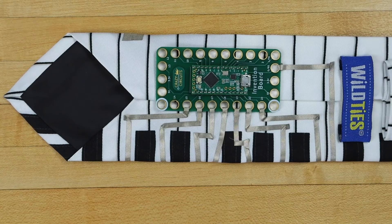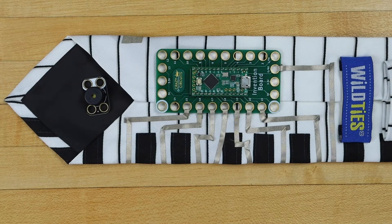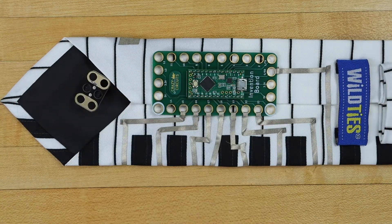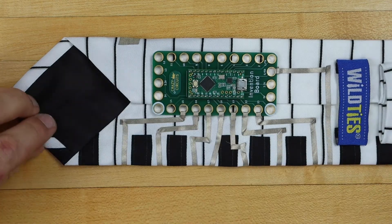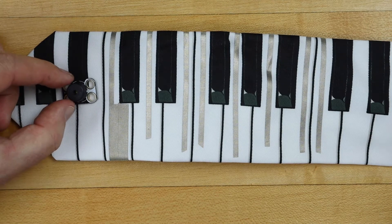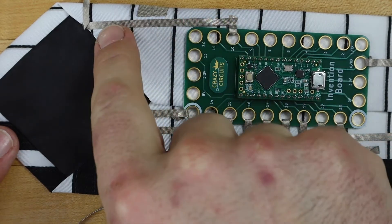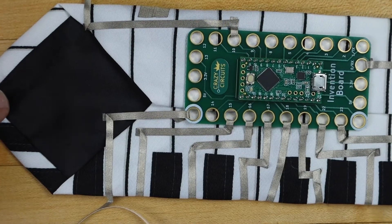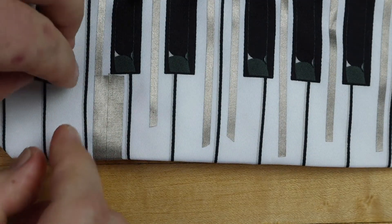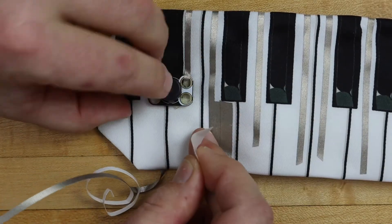Now it's time for our piezo speaker. We could mount it on the back, but it would probably be muffled. If we wanted to get fancy, we could cut a small hole in the tie and then mount the speaker in the back facing forward. But for ease of just showing how all this works, let's just put the speaker on the front — it's black and white, so we'll put it in a spot where it blends in. We'll lay down two pieces of conductive tape for the speaker, one from pin 10 and one from the ground connection. Those will wrap around the tie to either side of the speaker. We can connect the speaker with mounting tape or a few stitches of thread through the corner holes.